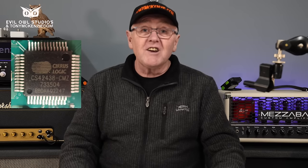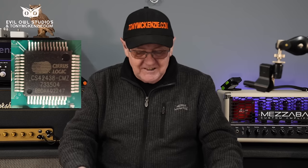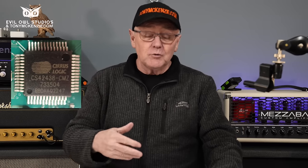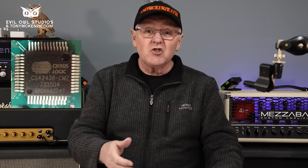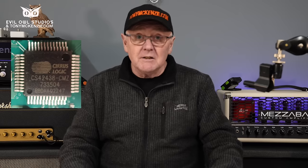Of course, they're not the same people today. It's all moved on from being in Richardson in Dallas, or as near to Dallas as you can get, to probably China, is my guess. Yeah. Well, here it is. It's a CS42448 chip. It's a 108 decibel, 192 kilohertz, 6 in and 8 out codec. But it handles, actually, both things, A to D and D to A. Now, normally, when I'm looking at these, I normally find an A to D chip and then later a D to A chip. This has got 2 in 1. I suppose it saves money in its own way, both for Cirrus Logic and for the maker, whoever that might be.